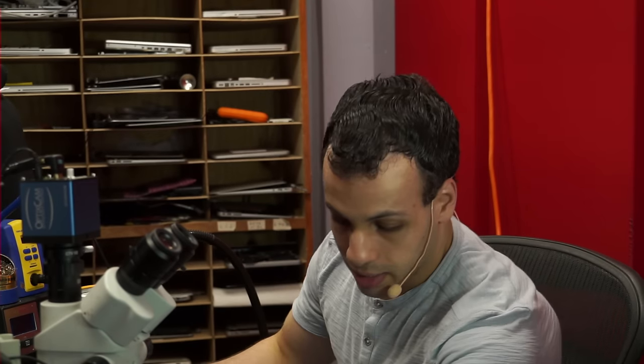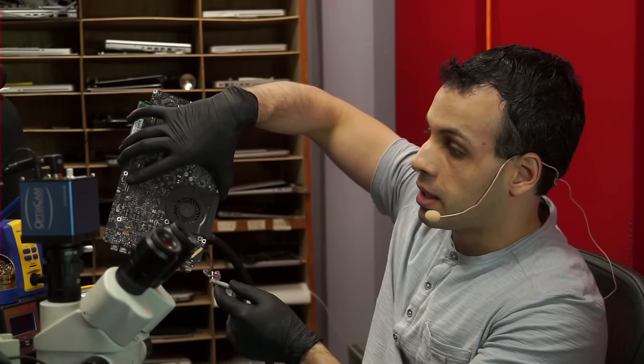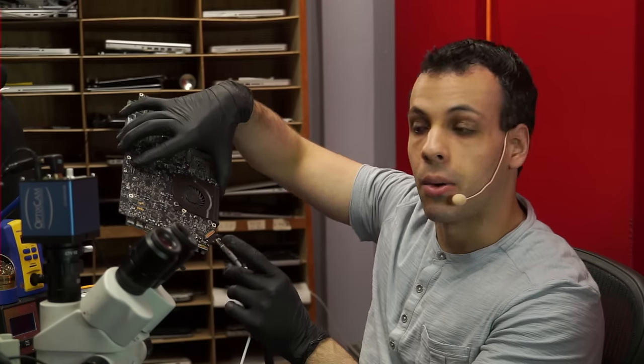So let's go ahead and get into this board. This is an 820-2849 board, and when I plug it in, you'll notice that I do get a green light. However, it doesn't power on. Now, let's go over the list of power rails, because the first thing I'm going to want to do in a no power condition is look through the power rails and try to figure out which rail it is that's missing.